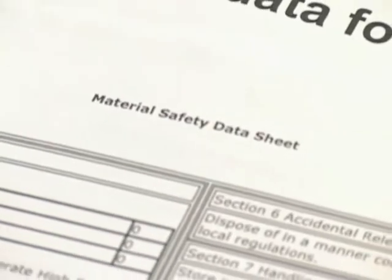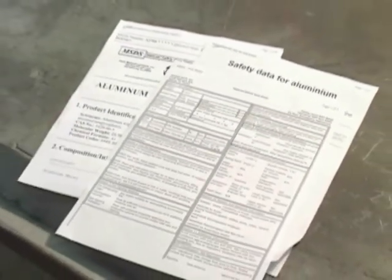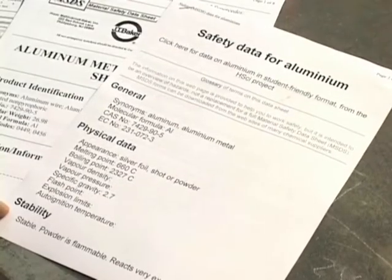Make sure you check the material safety data sheets to become aware of the specifics of the material you are grinding, such as stainless steel, galvanized products, and other exotic metals. Make certain you know the protection you require.